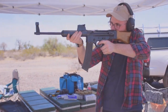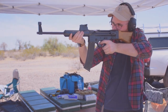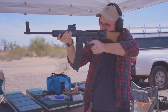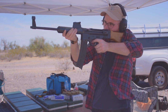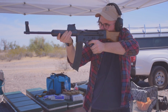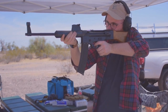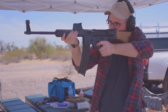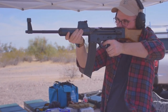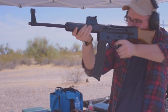Let's take a look at some slow motion of the 06H in action. One of Mauser's scientists, Dr Karl Meyer, analysed the 06's action and noticed bolt bounce before the action locked. From this, he calculated the heavy gas system could be removed and the bolt simplified, using a roller-delayed rather than locked blow-back action. This is where the rifle gets its H suffix from, meaning half-locked.